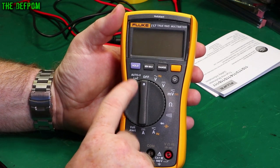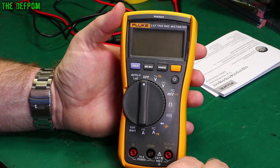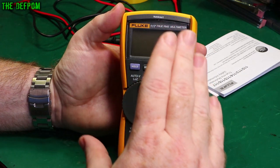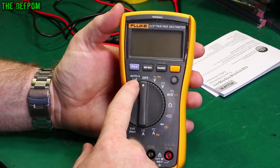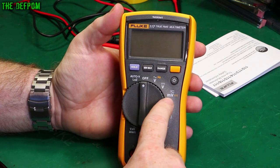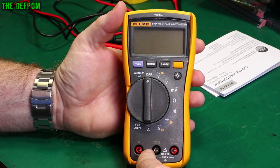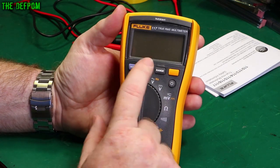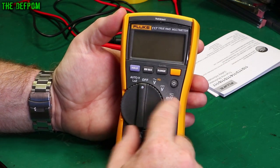There's an auto-voltage low-impedance mode here, which kills stray voltages on AC lines — it loads the circuit down a little bit, giving a more accurate reading and eliminating parasitic voltages that are floating around. It also does AC and DC in that same mode. Over here you've got voltage with Hertz, AC, DC volts, AC and DC millivolts, resistance, continuity sounder, diode test with capacitance, current with frequency, AC and DC current — and it's also got a volt alert. Buttons include hold, min and max, and range, which also does a low/high sensitivity setting for the volt alert.